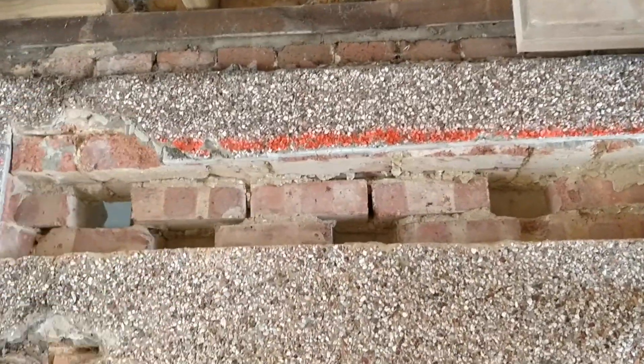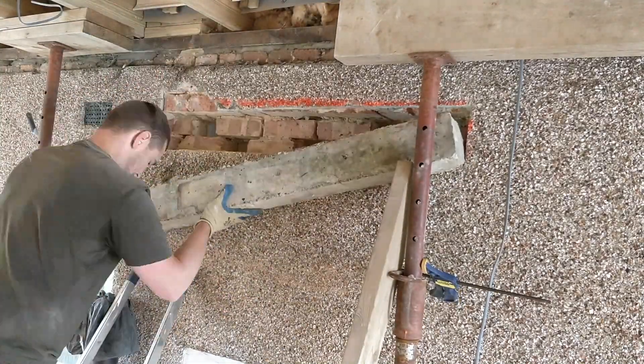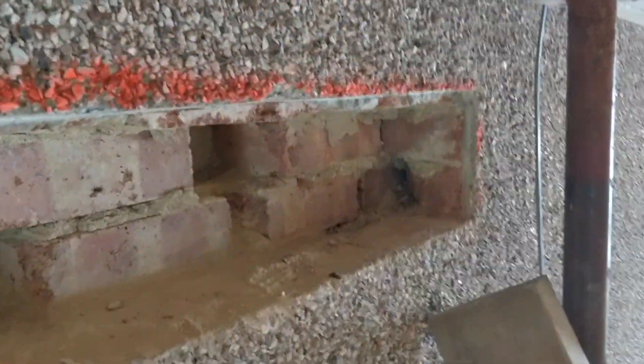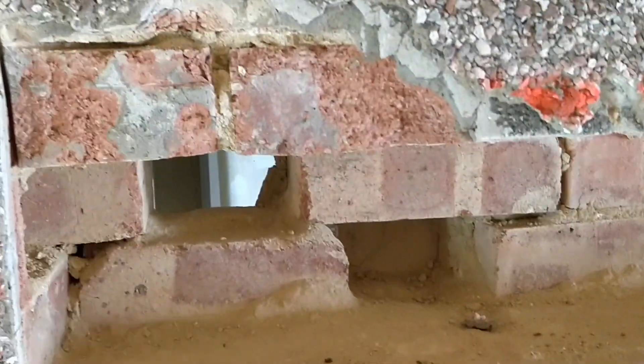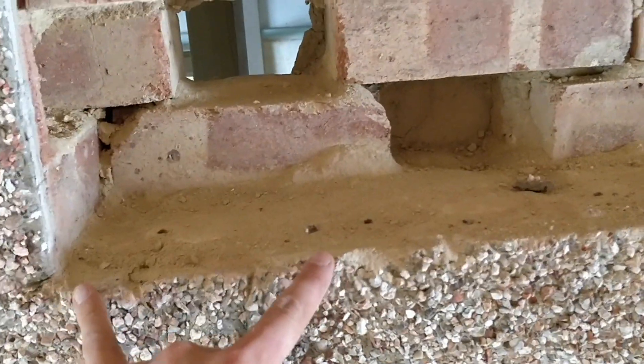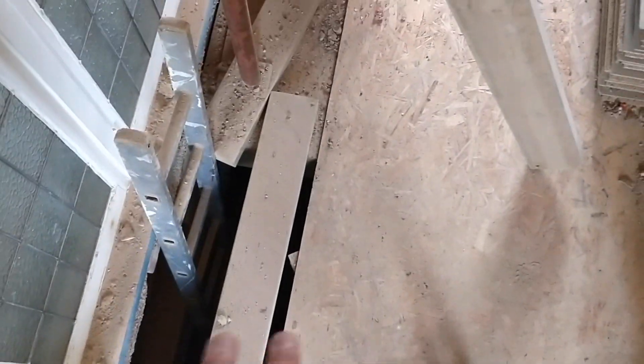You can see some of the mortar I've scraped out because I've got two lintels to go in here. I'm going to test one first. That was a short time-lapse for you but quite a long and exhausting process for me, and largely successful. This is just a little bit too tight so I'm going to scrape some of this sand out — all of this is getting removed anyway. It's only about having it bedded in at the bearing points, so I need to scrape a lot of this sand off, which will give me clearance to then put a bed of mortar in at that point.